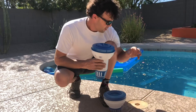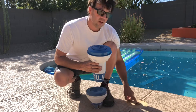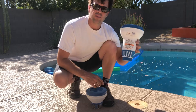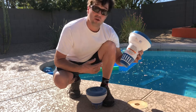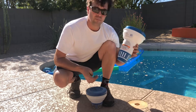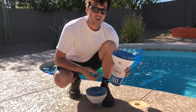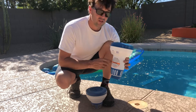The other great thing compared to the chlorine tower at the equipment or the in-deck chlorinator is that those only chlorinate while the pump's running and water's circulating. This floater is floating around the pool, getting blown around by the wind — it's constantly chlorinating the water whether the equipment's on or off. So I just find this is the best way to do tablets. It may be different in your area; consult with your local pool professional, but here in Arizona for residential pools, this is the way to go.